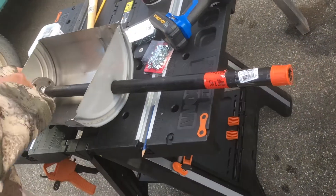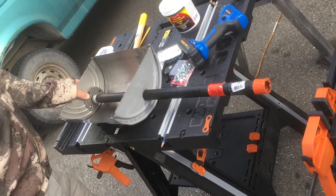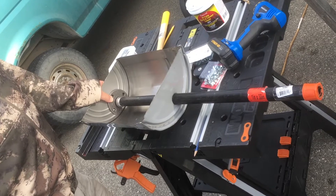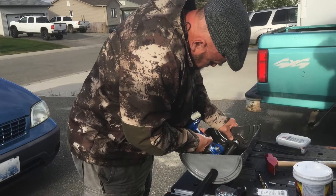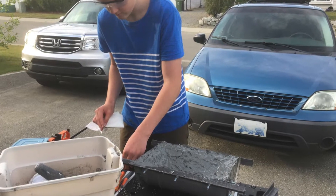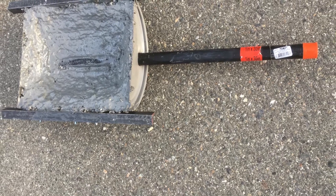We're going to put this pipe in and put a combination of perlite and stove cement. Simple charcoal forge: half of an oil can, some refractory cement and perlite, and a one-inch pipe connected to a hairdryer. And it works pretty well.